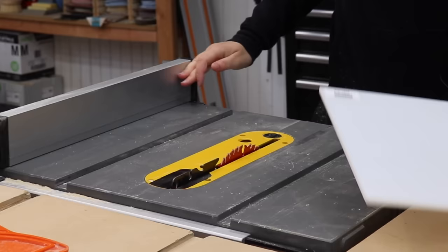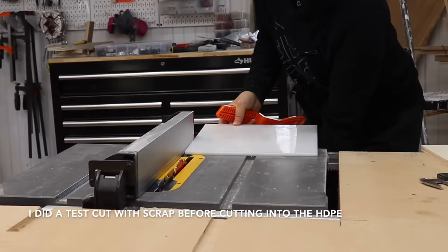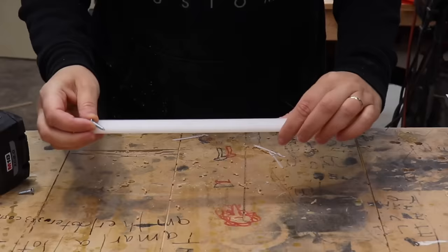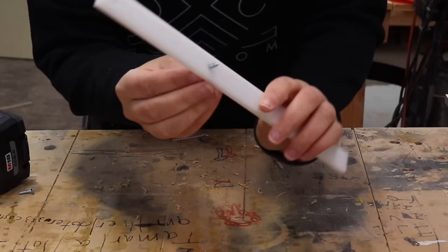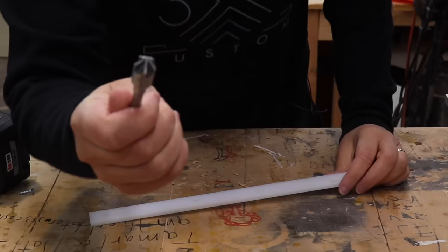Next up is the runner. I've had luck in the past using HDPE material — it's a plastic, like extra cutting board material. The reason I like it is because it's super stable and won't expand or contract with the seasons. I'll measure the miter slot and set the fence to that width. The key to drilling the holes is to make them wide enough that the screw fits completely through — if the hole is smaller, the plastic will expand outward and the runner won't fit in the miter slot. I'll use a countersink bit on all the holes.